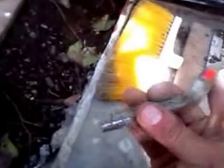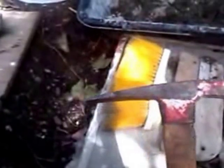And we have a tooling device, also a slicker in some terms. This one is for beaded joints and cove joints, also called weather joints if they're tapered. It does some nice work, and it's a good one to have. We're not going to use it today, so back in the mason's bucket. Then, obviously, you need your setting maul, and for this, we'll just use a brick hammer.